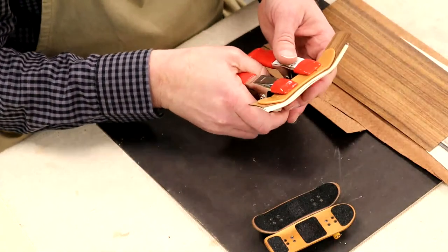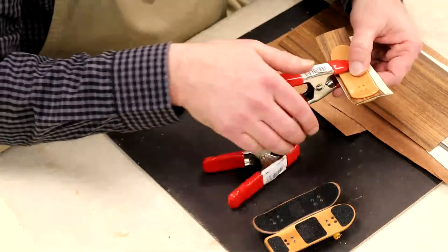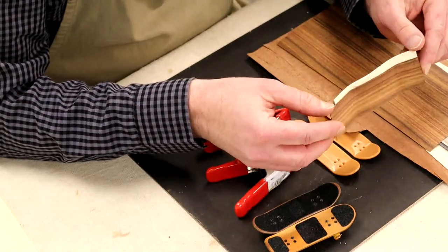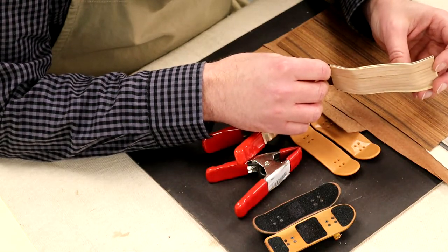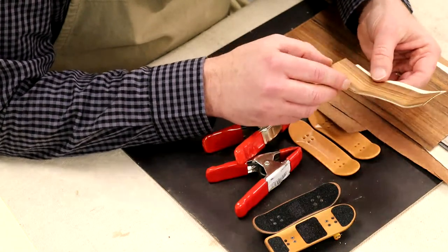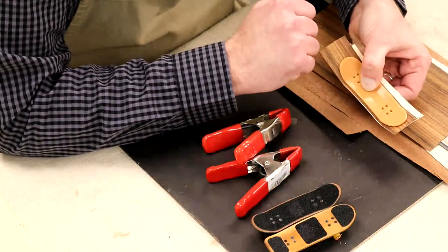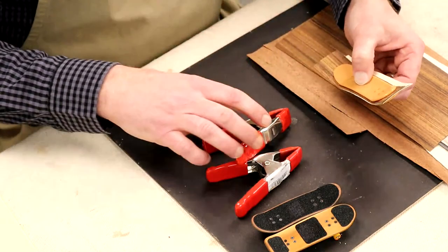You can see I've just got one in the former. All that is is a couple of these little spring clamps. We can take this off — that's our deck to be. I've gone for five sheets of this veneer, and that seems to give me a really good thickness on the boards. I need to mark off where the holes are on this deck, and I'll just do that with a bradawl in a minute.